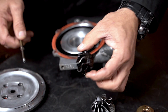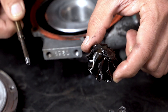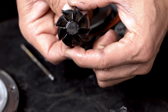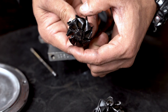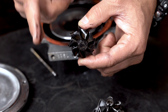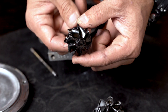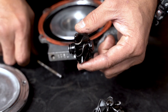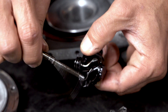Let's look at the turbine blade. All of these blades are folded over in the opposite direction of rotation — anticlockwise from what you're seeing here. Blades will always bend over in the opposite direction of rotation when they make contact with the respective mating housing.